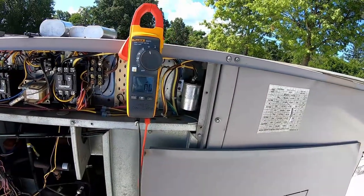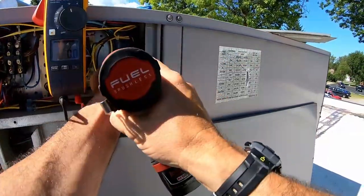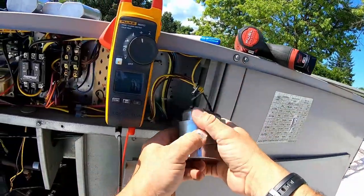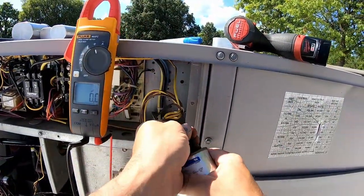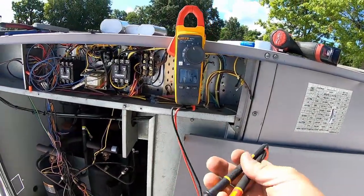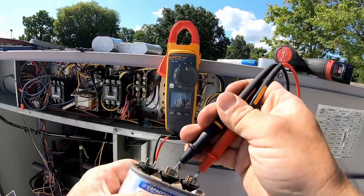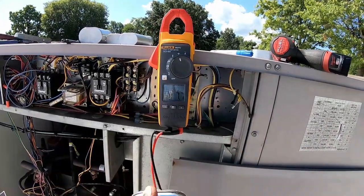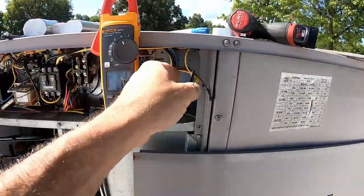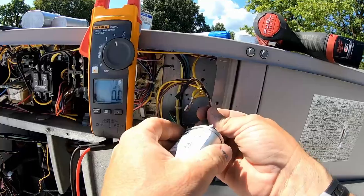This unit here — the guy found the capacitor weak. Came up here and checked it, and sure enough it was a little weak. Going to go ahead and change it. This is one of those dual capacitors that Carrier likes to use, which I don't stock on my truck. But there's nothing wrong with using two individual ones. We've got 8 on one side, 7.8 on the other — it's rated for 10. It's getting weak, so don't wait until it fails. We'll split the common away and get new ones on there.